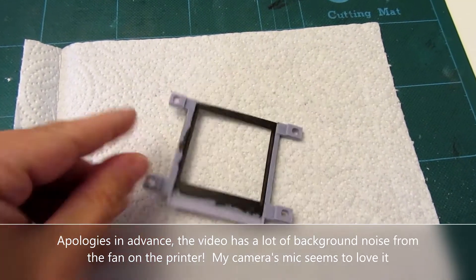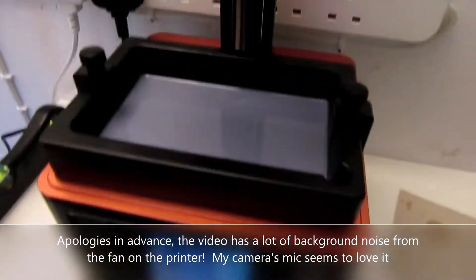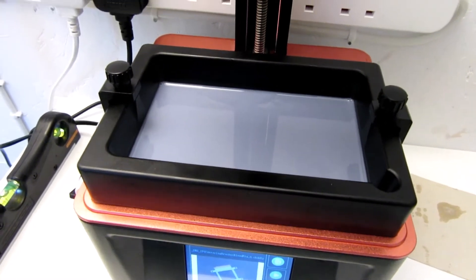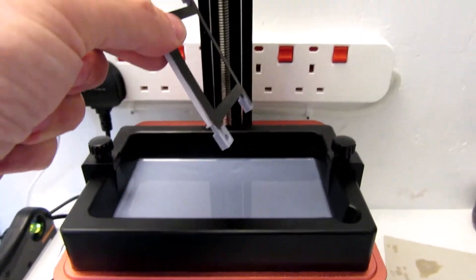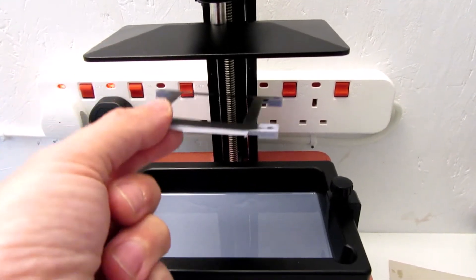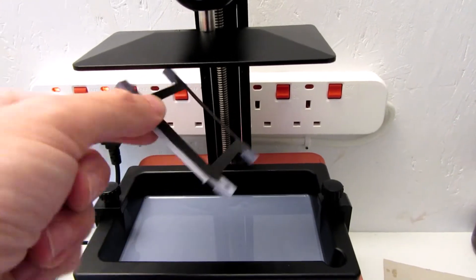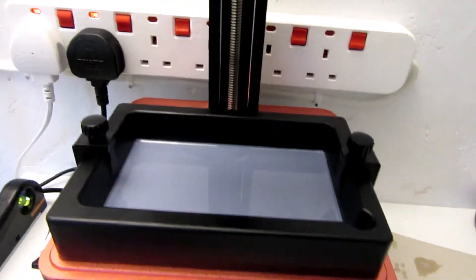This is what we're working towards. You'll notice the bottom bit's missing, and that's because of the size of the tank. To get the full size one, I'd have to make it on a whole load of supports and get it on an angle. By doing that, first of all it'd take forever because it builds up a layer at a time, and if it sits flat like this it's nice and quick. It can also end up a little bit warped — if it's flat to the plate, it's not too bad, actually.